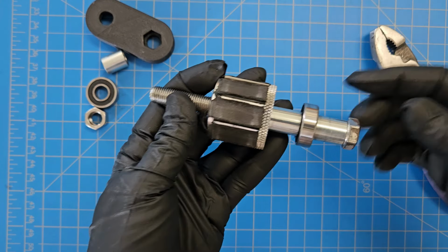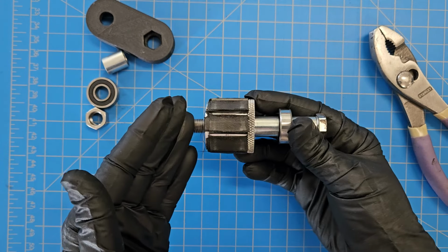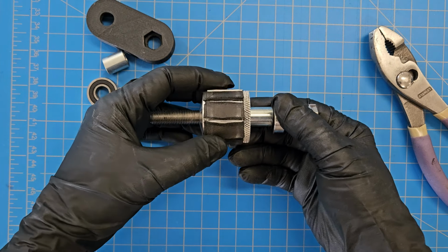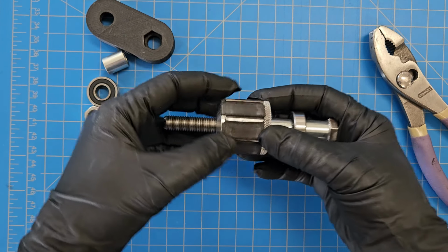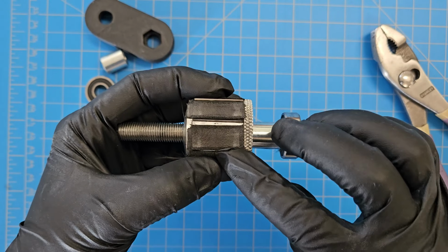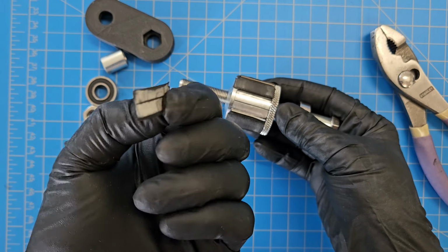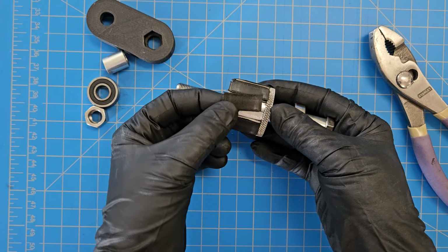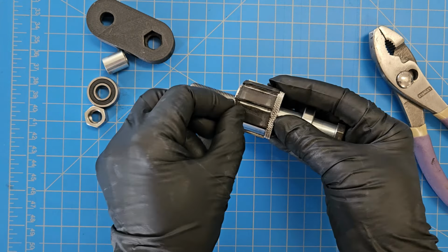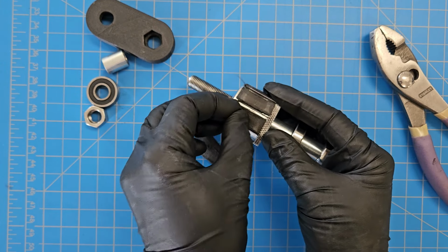So this is one bolt going through the entire thing, but I don't need to take this bolt out right now. So with an assembly like this, you have to be able to change these blades pretty frequently. They'll go maybe 2 or 3 rolls, but after that, you have to change it. So on here, in order to get the carbon fiber to feed properly, the way that this comes, there's nothing in here. You can add extra blades if you want to. These are pads that I have to add, and I have to change these whenever I change the blades. So I'm going to peel those off. I'll show you what these are made from after we go over the blade assembly here.